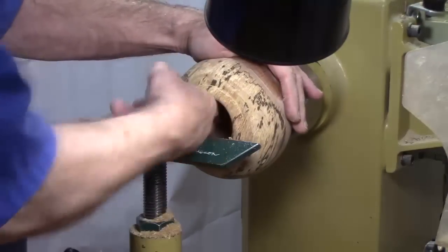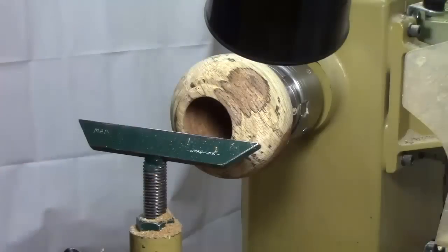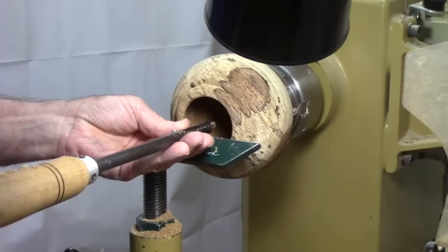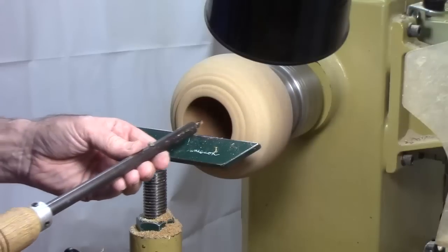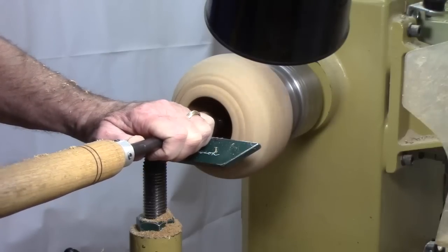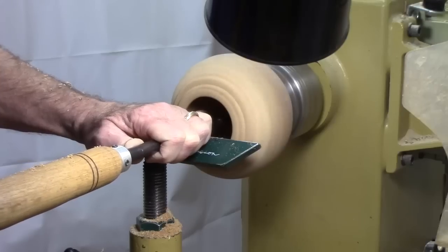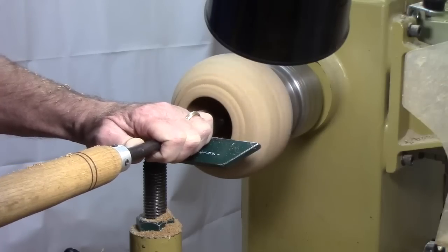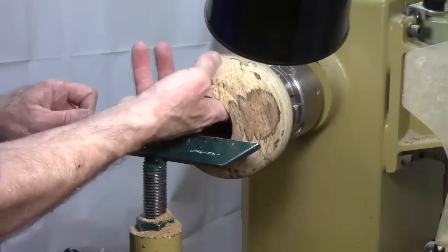The tricky part about this type of form is not getting the inside bigger than the outside. There's a little bit of a nub at the bottom, and the trick is you've got to get exactly on there and just pivot it sideways — down, up, and across — to get rid of that nub. You've got to do it very carefully because it's not moving very fast in the center. The trick is finding that center. I'm going to ease it in, trying to find where that nub is. There it is — down, up, and across. Of course I'm going to tell you I got rid of it because you're not going to be able to see it.